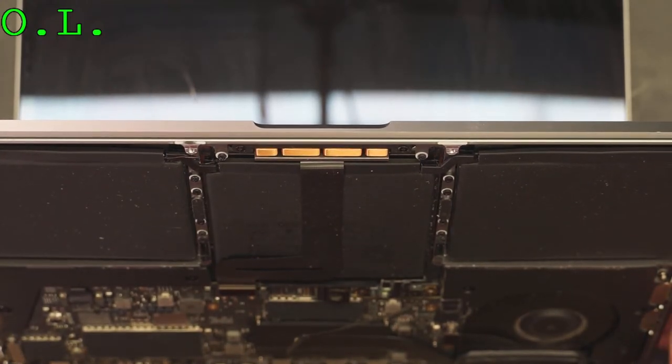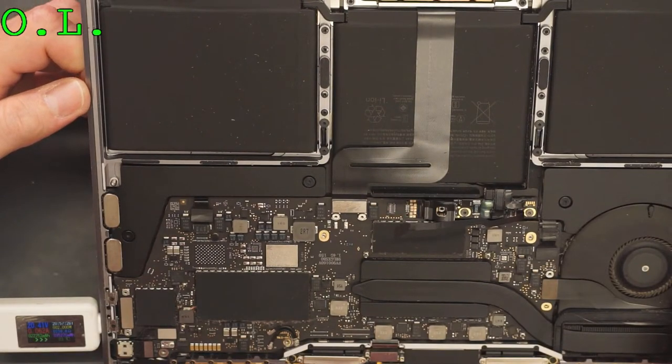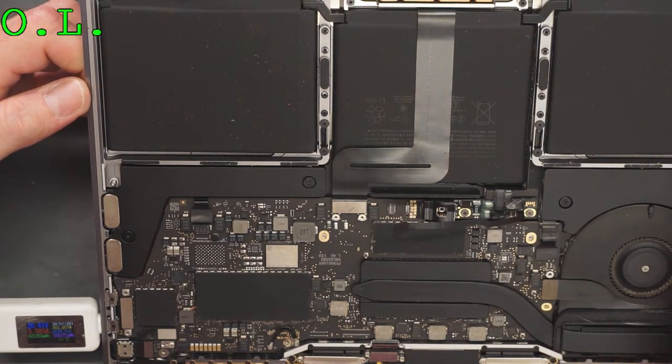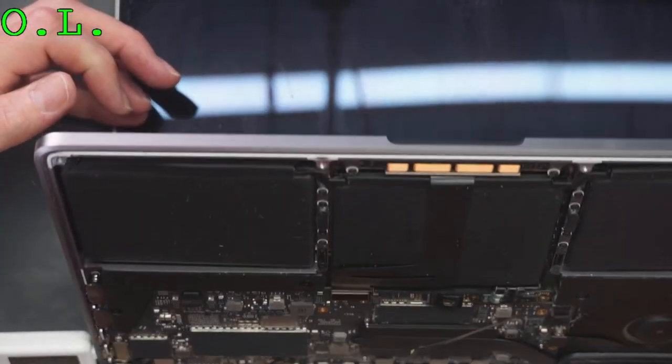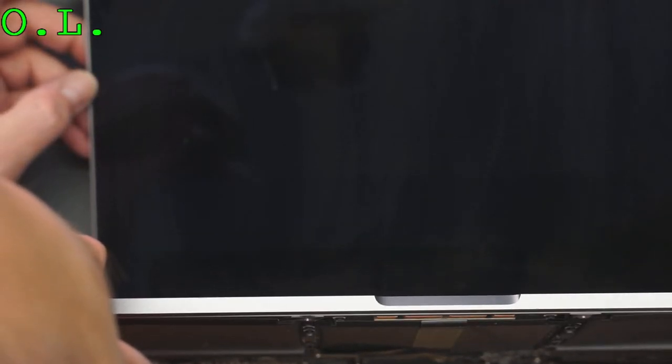Okay, let's see what we got. You can see that, though you can't really read it. So I got 20 volts, 150 milliamps, 400 milliamps, 500 milliamps, and hopefully this doesn't go straight to the boot screen. I just had a chime, and I have no backlight. Aha! See, standard issue. I have no backlight.